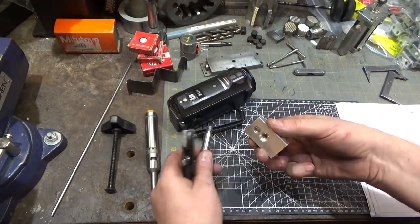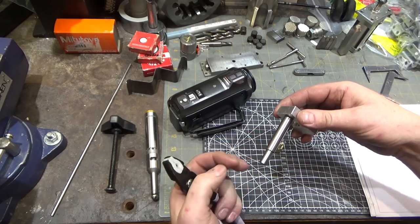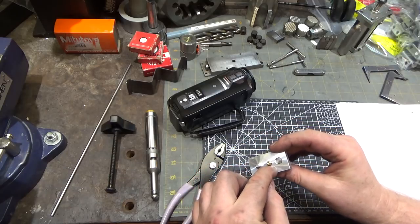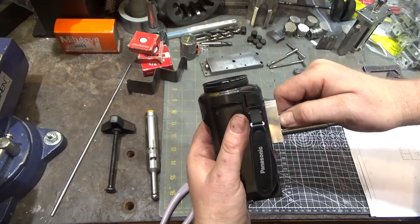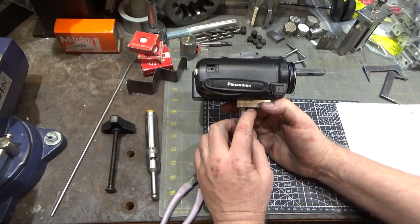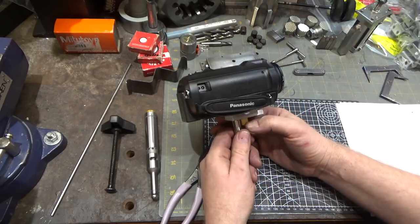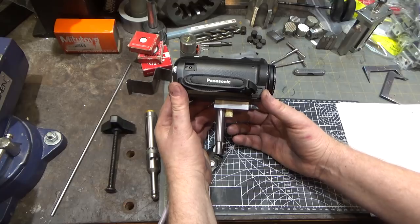Here is the final assembly of the camera adapter. This vertical stud mates with most of my holders — either the half-inch part fits in and gets clamped down, or the three-eighths. I made it kind of tight, which is good. This part just sits in here and floats. If I had been really keen, I would have recessed this side as well and put a circlip in there. It lines up with the hole in the bottom of the camera, and once this goes on it will probably live there. One thing I noted is that the thread depth on the camera is a maximum of .22 inch, so you don't get a lot of thread engagement. I might also slot the bottom so I could use a screwdriver to tighten it. Anyway, that was my project — hope you find it interesting. Hope to see you next time. Thanks for watching.